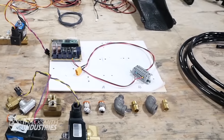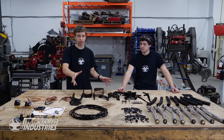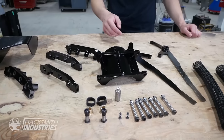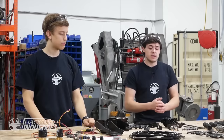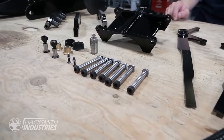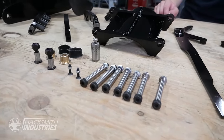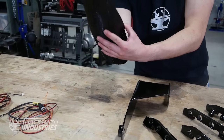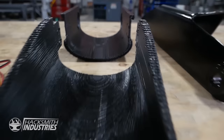We have our custom-built controller board, and here we have the frame that everything's gonna get attached to. For the frame of the Crysis arm, we're using mild steel as it's simple and easy to machine. We've got the whole thing TIG welded together, and we're using bushings to simplify the design. In order to keep the whole arm comfortable, we 3D printed some bracers that are gonna have steel inlays in order to allow us to lift a lot and still be comfortable.